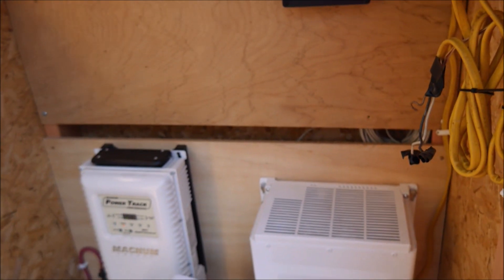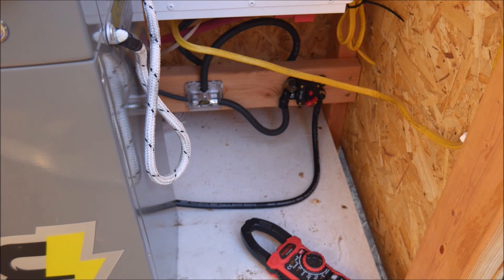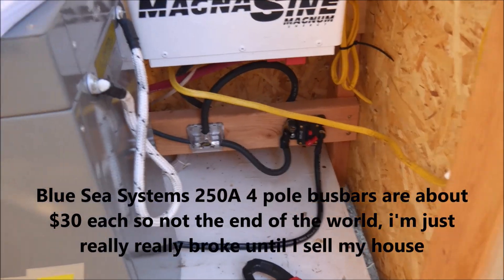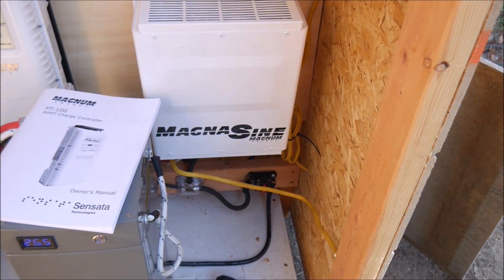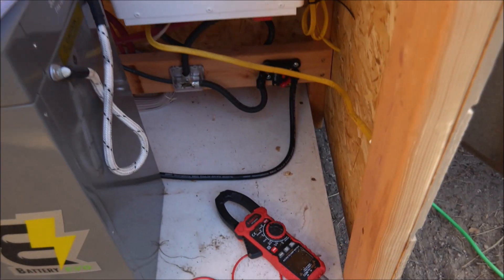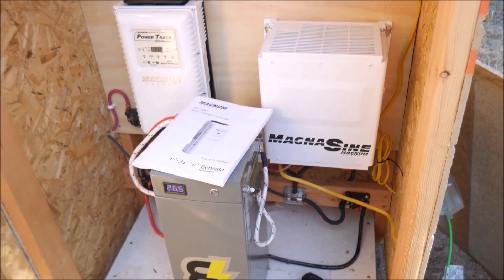The same thing happened again. I still don't know what it is. This breaker right here tripped. I know I don't need a breaker on the negative, so I may just bypass that. I really just want to get bus bars — I just don't want to fork out the money for them right now. It's a little alarming that I'm somehow tripping a 300 amp breaker. It ran about 45 minutes this time and then tripped, and I wasn't out here to catch it because it's 105 degrees outside. I have no idea what happened. I'm going to keep working on it and try to get in touch with tech support.